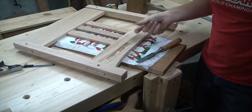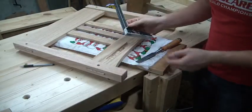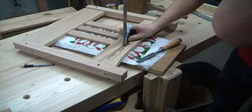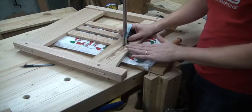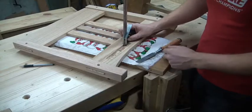Basically, I'm trying to make this groove a 1/4 inch deep. So every now and then I bring in my combination square, which I have set up to a 1/4 inch. I just set it in there and make sure that I'm at a 1/4 inch. If I'm a little lower than a 1/4 inch, it's not a huge issue, as long as there are at least two or three points that are dead on a 1/4 inch and nothing is taller than a 1/4 inch.